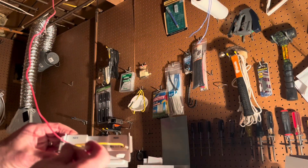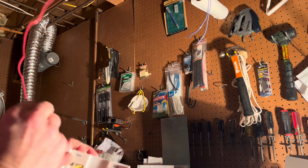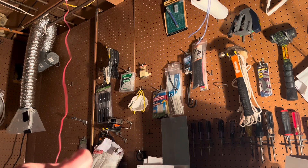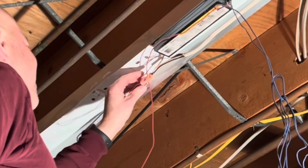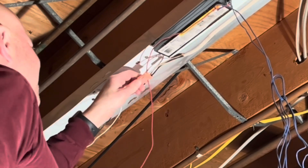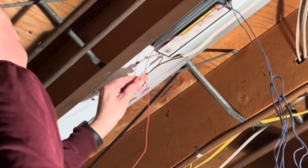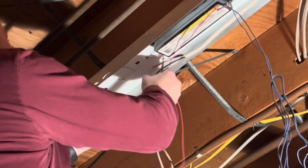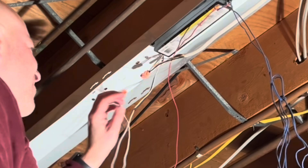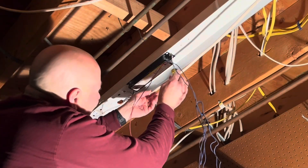When we inspect it, it's going to be the same thing — since that yellow wire connects the two ends, we just need to release that red wire again by putting a small screwdriver in that hole. Now, this was the original ballast, which is about 20 years old, so there was actually a connector from the power supply to the ballast. I'll just disconnect that and now I can remove the ballast.